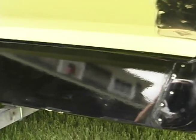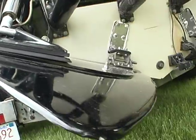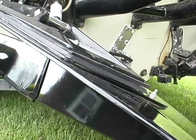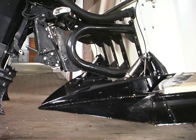The skirt has an airtight seal to the rear foil. The rear foils close off the tunnel formed by the side skirt and the V hull. Because these massive foils are mounted to trim tabs, the operator has dynamic control to compensate for the ever-changing conditions at sea.